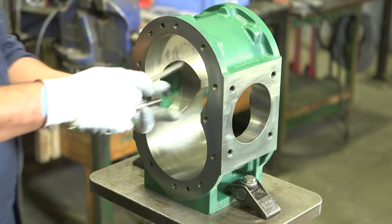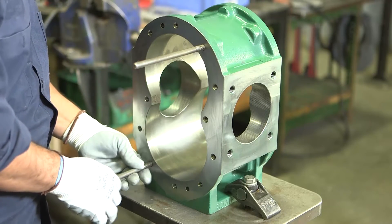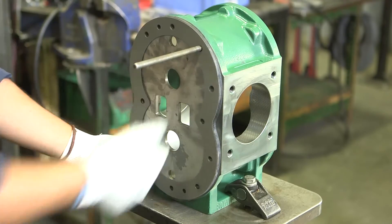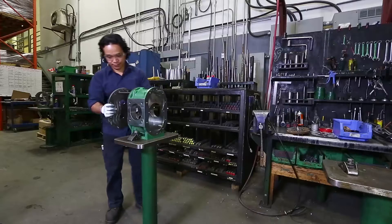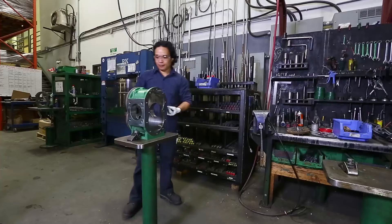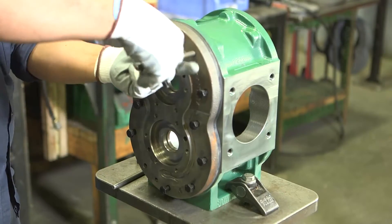Let's begin with the assembly of the center case and gears. With the center case anchored to a surface, insert the two assembly pins into the front of the center housing. Push one housing gasket next to the center housing, followed by a hardened wear plate and one additional gasket. Install the two dowel pins into the holes on the front plate, then place the front end plate onto the assembly pins with the end cap pockets facing away from the center housing. Put ten 3/8 inch hex bolts into the bolt holes and tighten by hand, then remove the assembly pins and install the remaining two bolts.